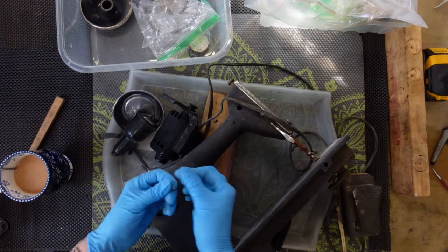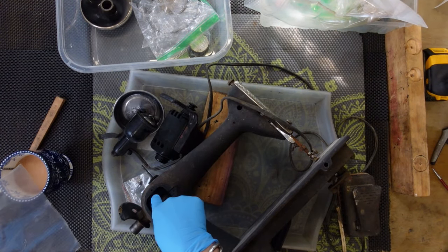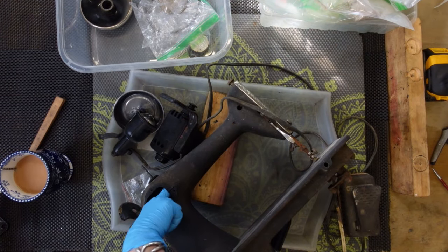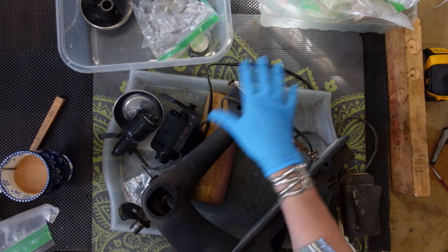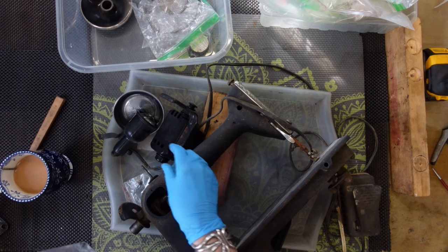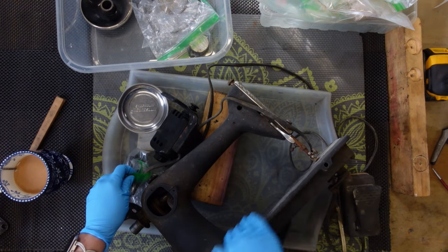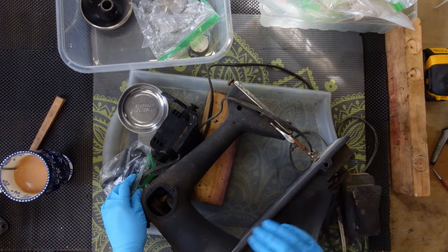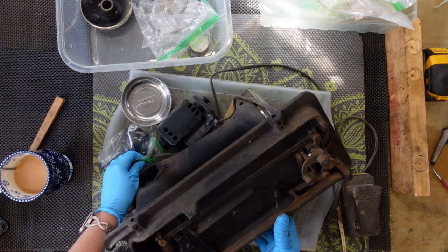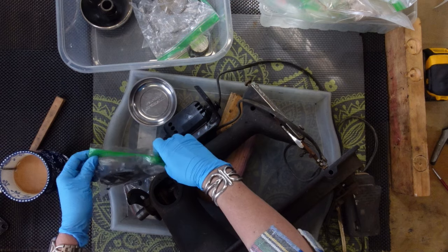My electrolysis tank is great for iron things — it's not good for aluminum, but for iron, in addition to getting rid of paint, it also loosens up rust at the same time. I'm not pulling out the main shaft or vertical shaft because you have to pull the main shaft first, and we just don't go there. I think I will be putting her in the electrolysis tank, which means this will be a good experiment to see how the Godzilla finish strips off. She is very rusty down here — not just dirty, so we're going to be doing a lot of rust removal.